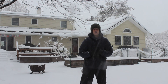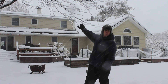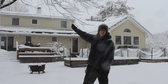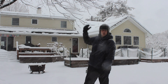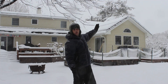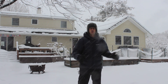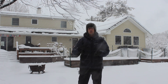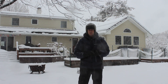Obviously we'd wait for the snow to end, but I wanted to show you the type of situation I have here. On this home, on the top portion, we have some panels that are very close to being flat — they're at 15 degrees. The other ones are at 35 degrees, facing due south. On this portion of the house, you'll see some at about 30 degrees as well, facing east and facing west. So some of these panels will clear faster than others, depending on the type of snow, the temperatures afterwards, and whether it's wet snow or a very cold light snow.